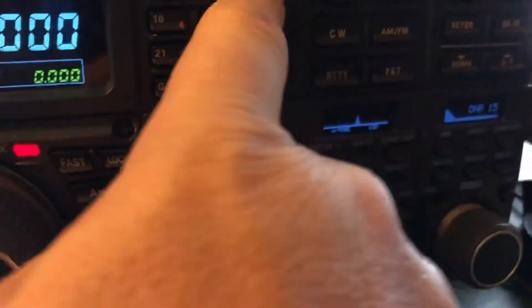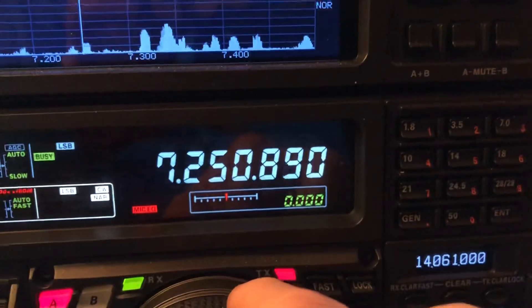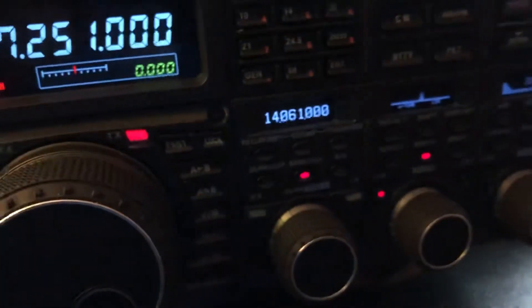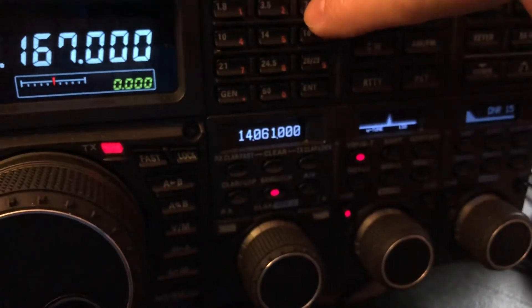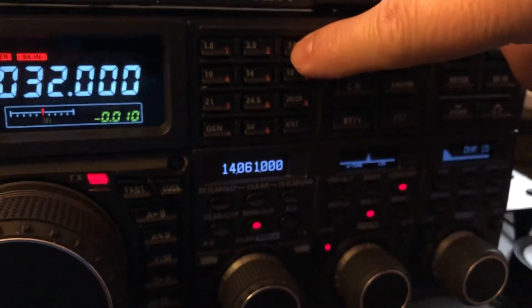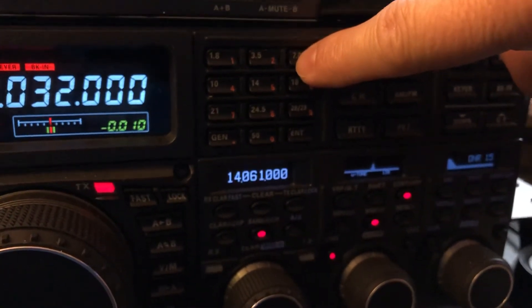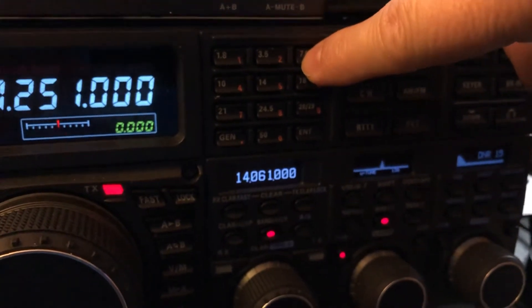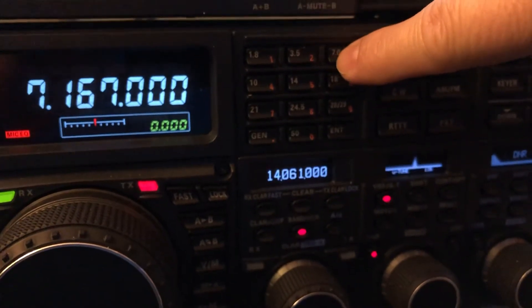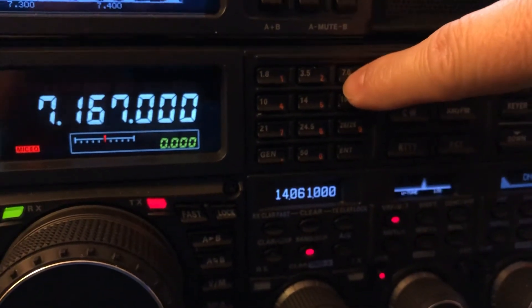Watch the DSP change according to how I had it last. So I'm on 7250. All right — watch the DSP as I cycle through the 40 meter button. See? There's CW with DNR, filter width, and APF — audio peak filter. Phenomenal feature. And then here on this particular frequency, I've got just DNR and a filter width setting. And here I've got the microtune and DNR. So, again, it's called band stacking. It's a great feature.